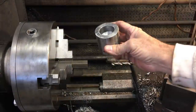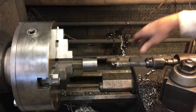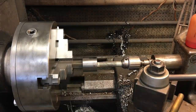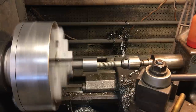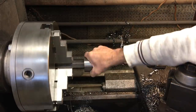Here I decided to make a drill pilot, and it actually sped things up a whole bunch. Generally when you're trying to drill the end of a piece of material with a regular drill bit, it's really hard to keep the drill bit from wobbling, and there's time involved putting a centering bit in and taking it out every time. So I just made this little slug that I slide on there, slid a spring over the drill bit to keep the slug on — basically just a pilot to keep the drill bit straight, just to get it started in the hole a little bit. Then I take it out and do my drilling. It worked great.